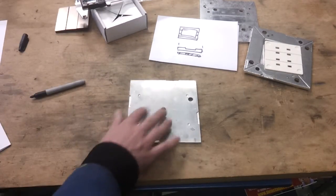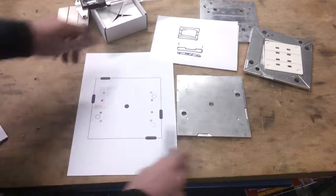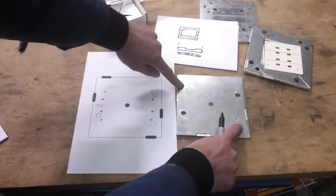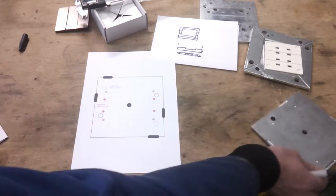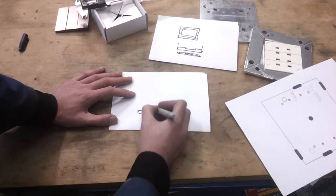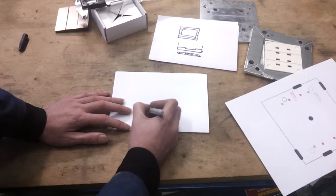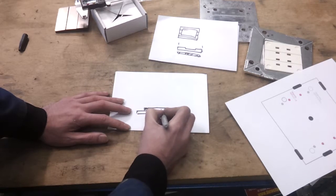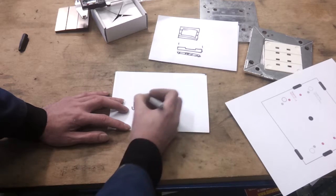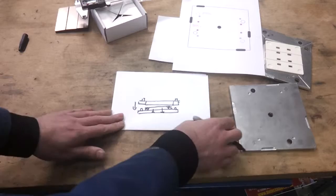Now because I've already got a few plates here I think I can reuse this one. I've already drawn it up and got some pry points on the mould. I've got some points on here for magnets but I didn't use them, so I'm going to add some more just in case. Then I need to re-drill these for the guide pins. For the new parts I'm going to start with a base plate, then have a slightly tapered core inside so I can get the frame off — this will simply be bolted in from the back, then I'll have guide pins and a surround which drops over the top, and then a top plate that comes down on top.